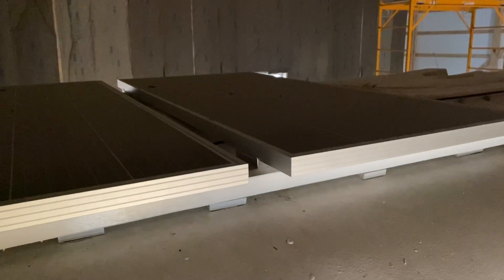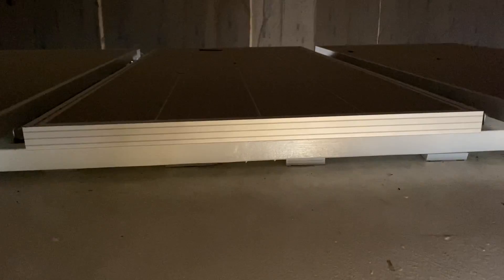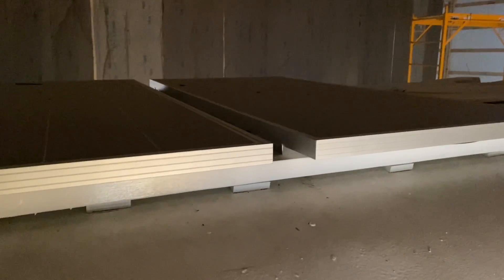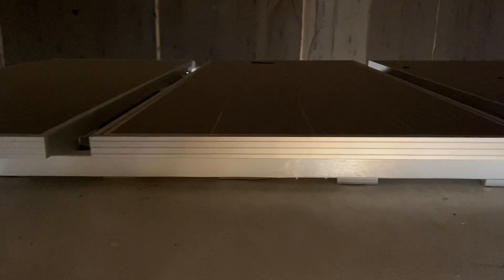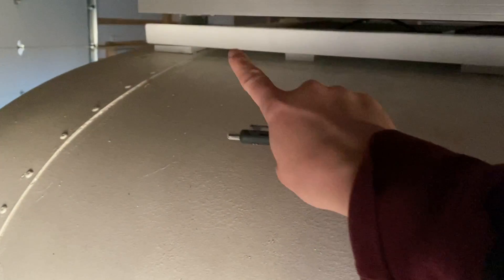Today we are giving you a solar university. First, let's start on my favorite place to be - the roof. So as you can see, we have three panels - they're 200 watt panels from Rich Solar. They were kind of pricey but I think they're going to do the job. We wanted a lot of power because we need a TV and our stuff. They're attached with these little brackets onto just two by fours, and we have little wedges to keep those level so that our panels aren't wobbling as we're driving.